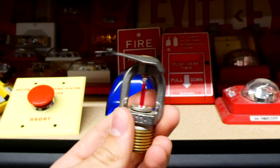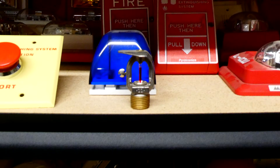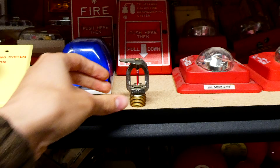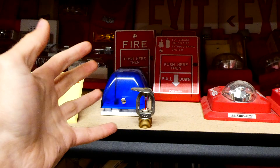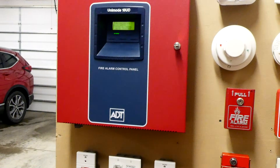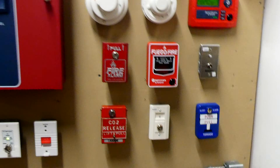With that being said, it's pretty easy to realize that these systems are nothing like sprinkler heads in a wet system that you would find in a building. These systems are more like a deluge system, where there are several discharge heads that are open — so there's nothing keeping agent from coming out — placed throughout the facility or area where they want CO2 protection. If enough devices activate, the CO2 release system will send CO2 through the piping to those open discharge heads and release CO2 agent into the area.